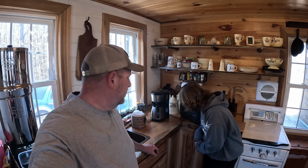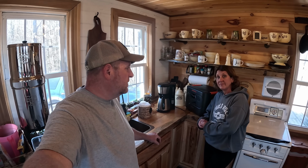757. And how many hours will it run that coffee maker? 2.3. Does a coffee maker run all day, 24/7? Nope. Only runs for like what, 10 minutes at the most? Maybe 15? So it probably only draws about 250 watts.